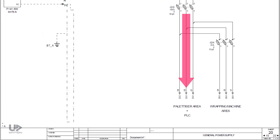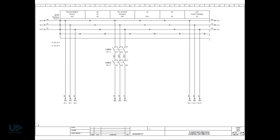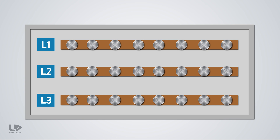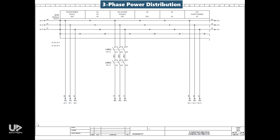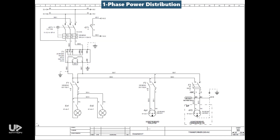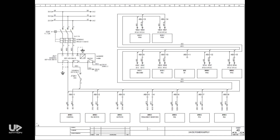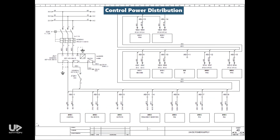The first output is going to page 22, which is the next page. On this page, the three-phase power has been distributed inside the panel using a distribution block — nothing but some pre-made busbars with screws on them for making connections simple, easy, and safe. We then see the same configuration until we reach the single-phase power distribution, which is used for utility items like the panel lamps, sockets, fan, and the limit switch of the panel's door. The next part is assigned to the control circuit's power supply, which is 24V, as discussed in previous videos.